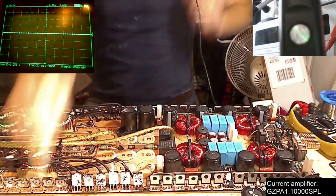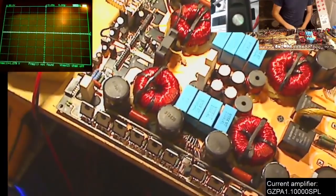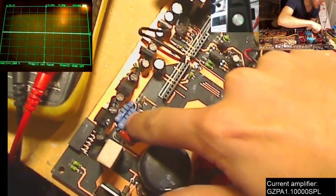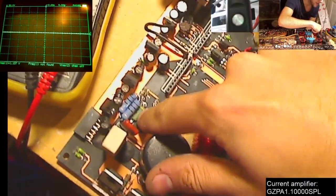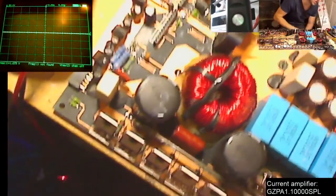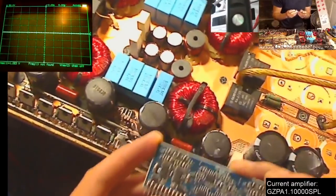The repair on this amplifier was quite horrific. I've had to do quite a bit of work to get it up and running. Repairs include the muting transistors by the driver board, and some green inductors that had failed. I used two 10 ohm resistors in parallel to give me 5 ohm as a temporary replacement for source resistors — that'll swap out for the correct size when it arrives. We had a completely blown output section with all the FETs out, and the driver board was very badly damaged too.